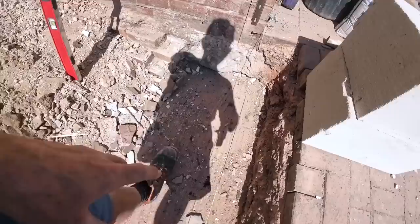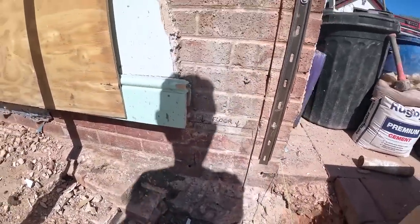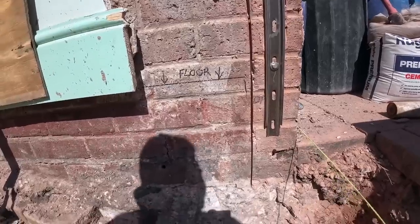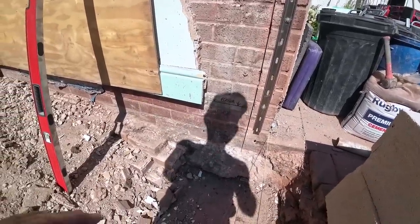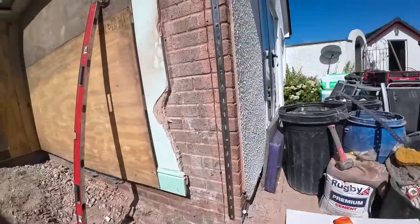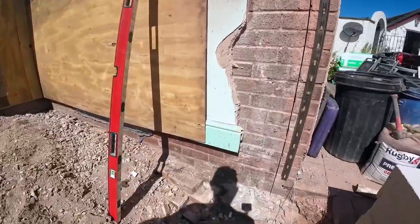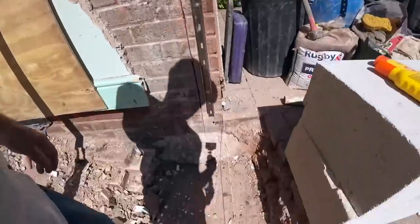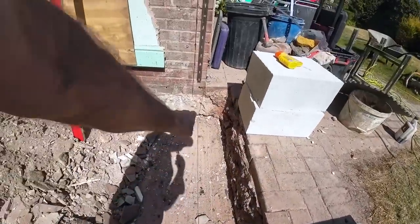As you can see, this is where we've got 900 concrete here, and we're still not touching the existing concrete on the extension, which goes three down to damp, and straight onto that. Which is about 9.5 inches of concrete, and below that was poor. You've got to go down another 18 inches at least, maybe more, to hit good clay. So that's not on very good ground. That's not a conservatory. That's a full blown extension, 1.5 storey. So that's not very good. But we kind of underpinned it with ours, so we're going to pack that up.